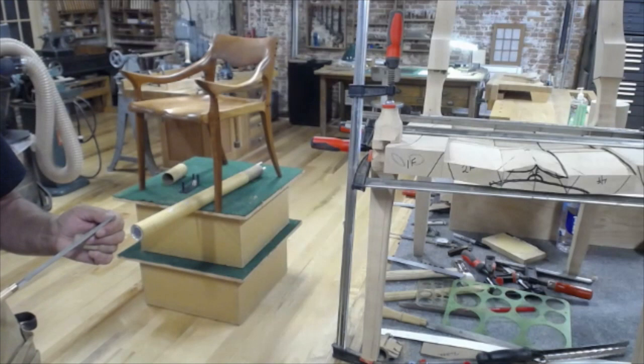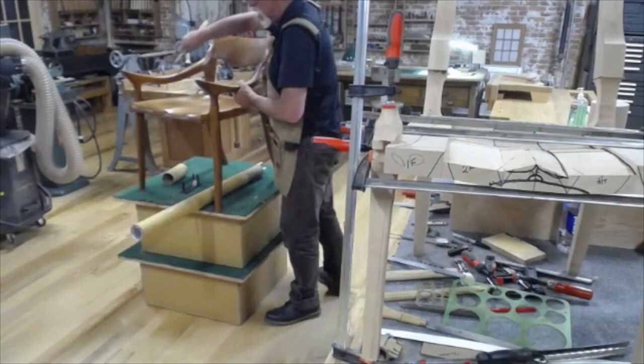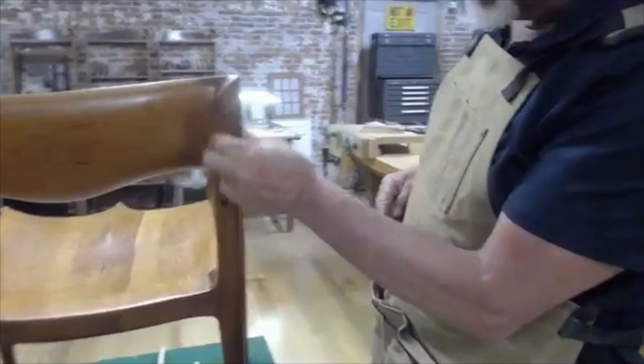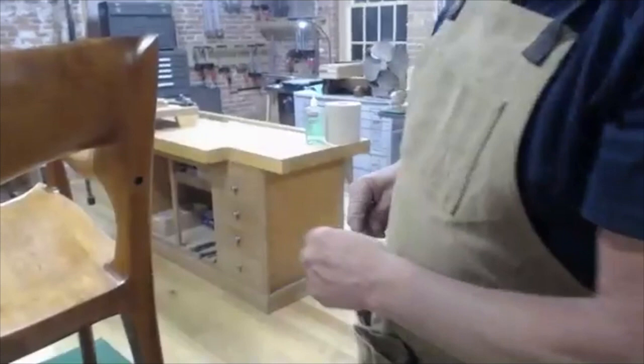The one last thing I think that's worthy of sharing with your members is one of Maloof's iconic signature things. On the back of the chair, whether it's a rocking chair, a high back chair, or this low back chair, a lot of people think this is a bit of a challenge to make. Some people call it ears, or a petite ear. On a rocking chair, that ear goes way up, but it's got this flute in it, and you feather it into the back of the seat.